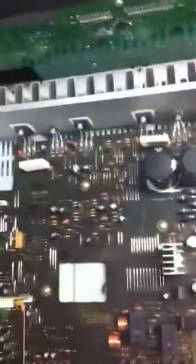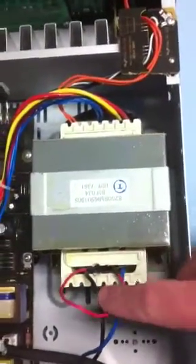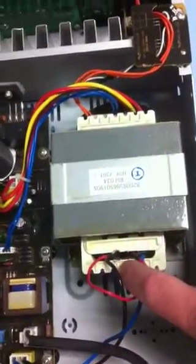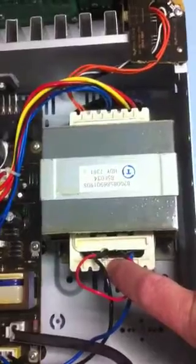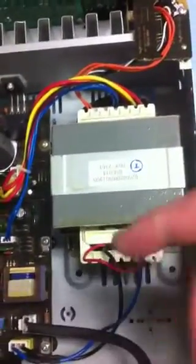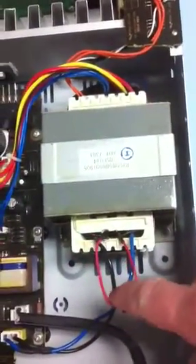So I was about ready to throw this away, but I started digging in this transformer and they have a small thermal fuse between the primary and the secondary. It's just a little ceramic pellet down in there, and I was very carefully able to dig it out, and actually using a pair of needle nose pliers I could crush the ceramic housing, and I was able to pull the two leads up enough that I could solder a jump wire to them.